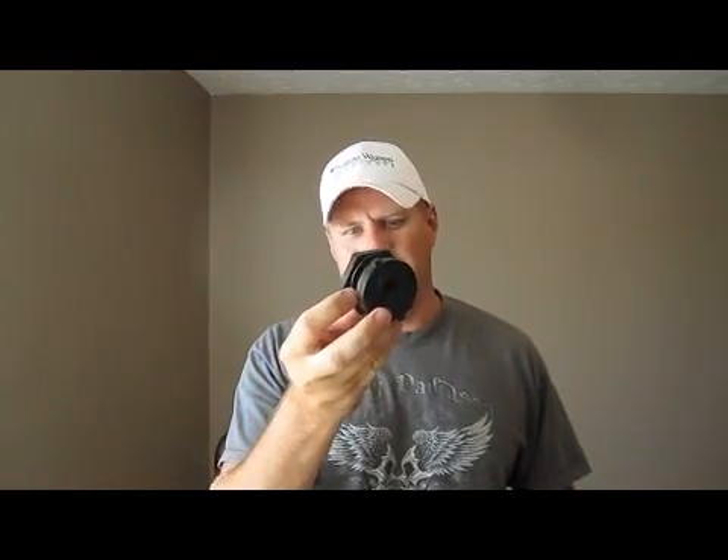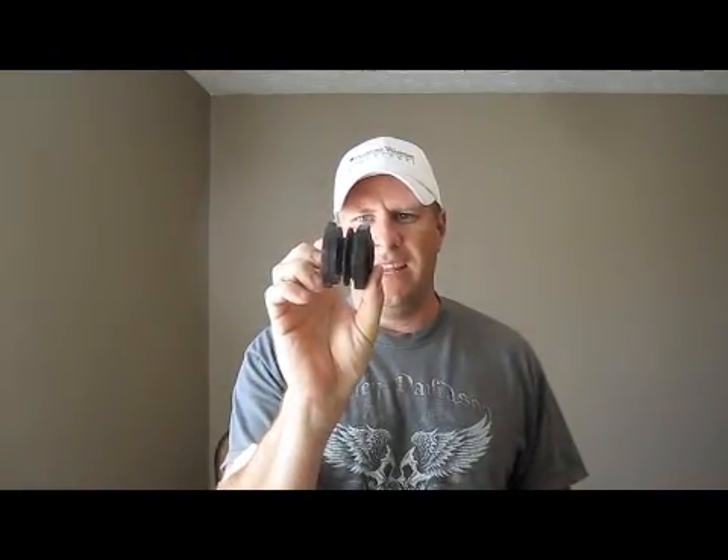Here's how we've done it. There's my bulkhead. You want to take one of these bulkheads — I believe this one's a half-inch bulkhead — and this is going to go right above your water outlet that's going to your pump. This goes right above that, and you install that, and inside that is one of these.